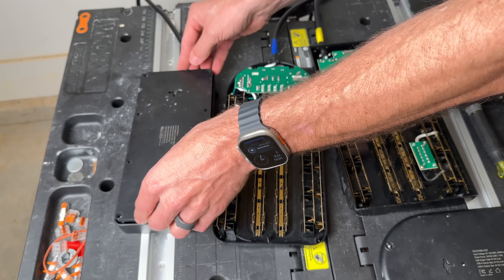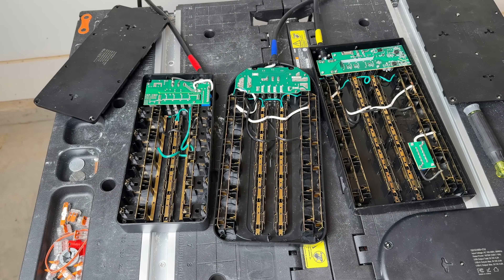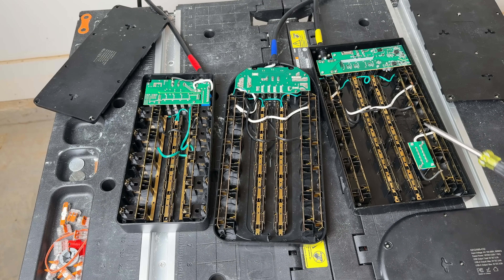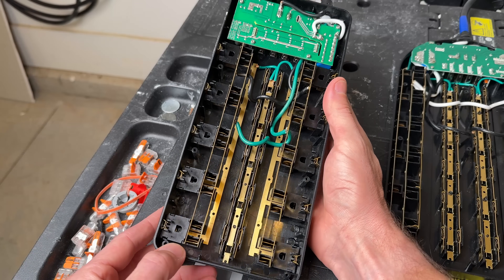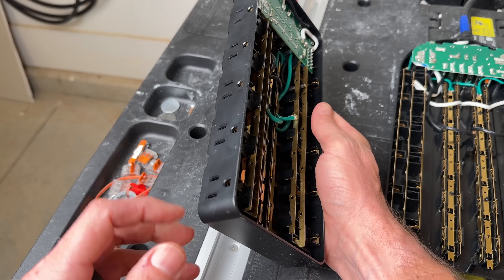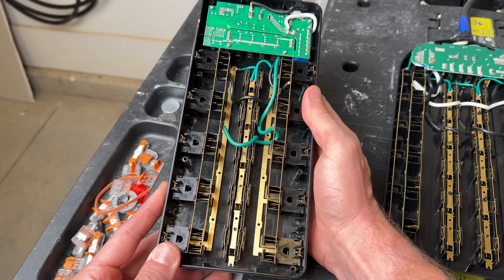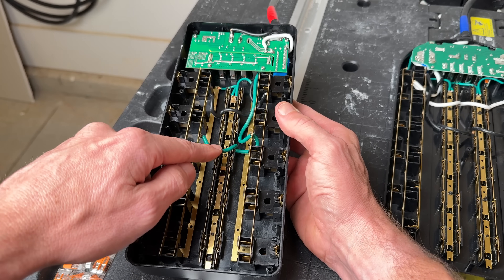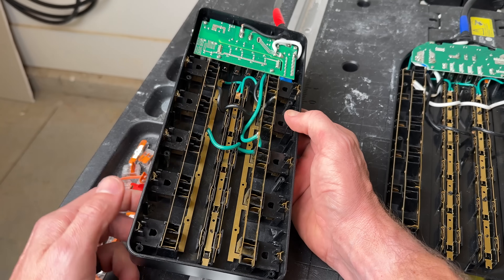This one's interesting — this one has those outlets on the side too. Now we'll take a closer look, but overall I don't love the combination here of wires and then kind of bus bars connecting everything up. Starting off with the red one, all the designs are actually fairly similar, even with the exterior looking quite a bit different on this 25-outlet power strip. I don't love that they use green wire for your ground and then also green wire for what I believe is the neutral — they're just using the same color wiring.